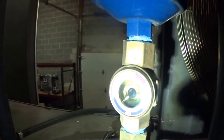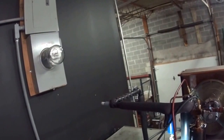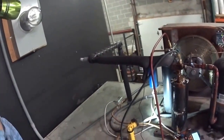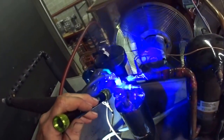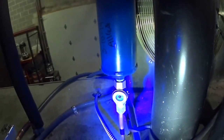The evaporator looks pretty cold, but it's a chiller. The dot in the center of the sight glass is nice and purple — that means it's a very dry system, which is a very good sign. The sight glass is full now with pretty healthy condensation coming back, and it's not going into the compressor. Here's my fluorescent dye kit. I keep an extra set of glasses in case I'm with somebody. I went around the system already looking for leaks.